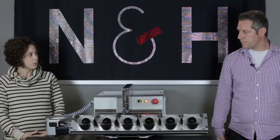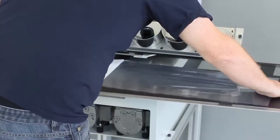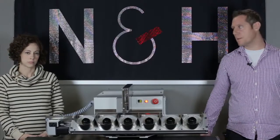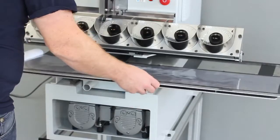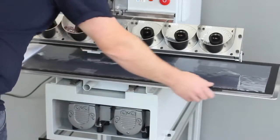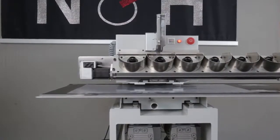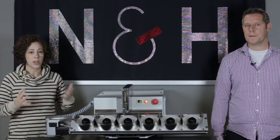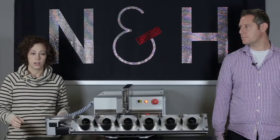You mentioned a tray — what is the tray and how do you use it? The tray is the surface which holds the transfer paper. The nice thing about the tray system is that you are able to use multiple trays. That means while the machine is working with one tray, you can prepare different trays so you don't have any downtime. This is a very unique system — not only can you prepare other trays while a tray is running, but you can also run designs that have more than six elements, colors, or sizes. The way you do that is with this pin system — the pins lock right here with the tray, and that's very important for registration.